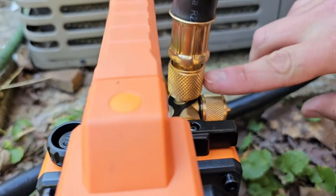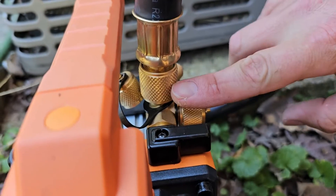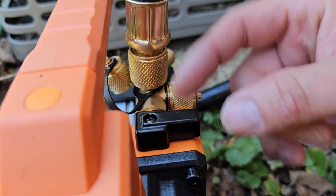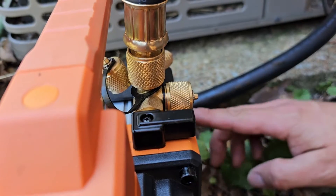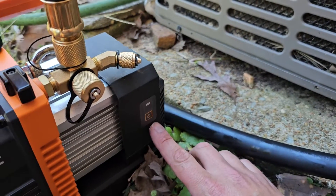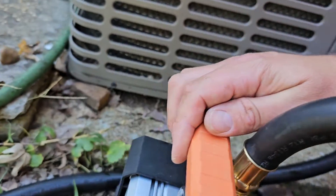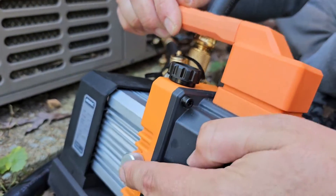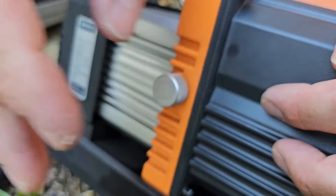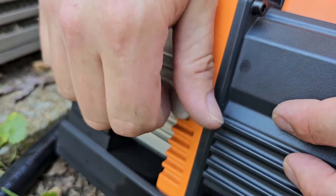You can see the other side is 3/8 inch. When you get ready to start the vacuum pump, we're going to turn this shut-off or check valve on. Here's our power button. On the other side, some vacuum pumps don't have a ballast and some do — here's our ballast. We're going to open this up, and when we get down to 3000 microns we will close it.